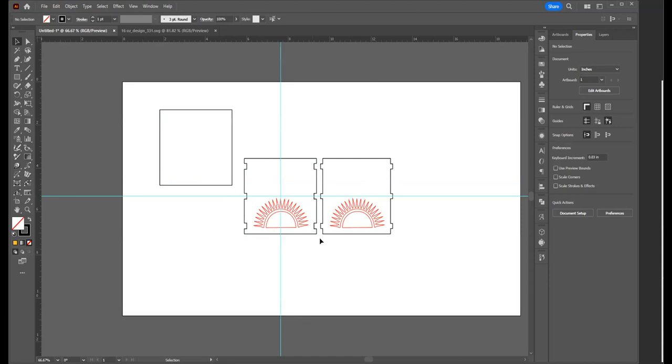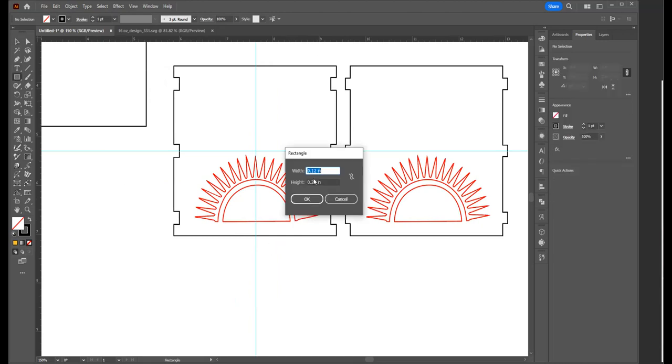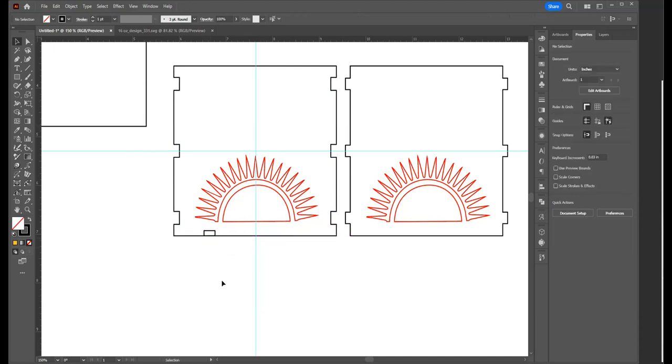So for example, on the bottoms of these guys, we had 1/4 inch tabs that were made to the 1/8 inch material. So what we're going to do really is turn this on its side. And the bottom doesn't really affect where you have tabs on top. If you decide that your bottom is going to be a base that's below this box, then you would have tabs outside. And if you decide that the bottom itself is actually going to be hidden behind this box and go inside the box, then you would have to have a slot that's built in inside the box like so. So what I like to do is hide the bottom.